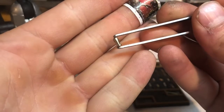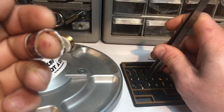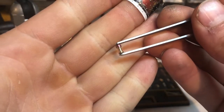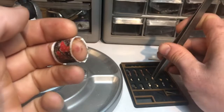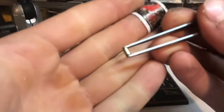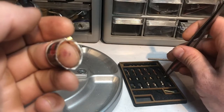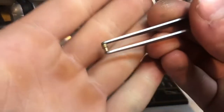Okay, pin 2, bomb looking spool, upside down-ish, standard on 3, 4, really sharp spool, that was our troublemaker right there. That also went along with the undercuts. 5, standard. And I did suspect a T-pin, and there it is right there in 6.